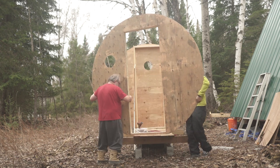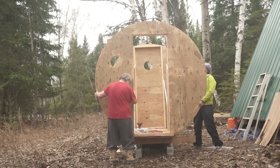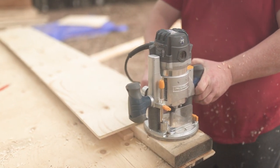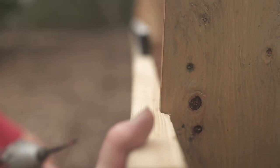From there we started the process of preparing our forty or so eight-foot two-by-sixes. We prepared them by cutting a half-inch dado into the ends of either side of the board. These would align our end caps to them and allow us to pinch them into position before screwing them in.